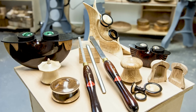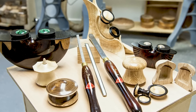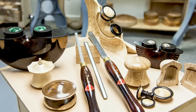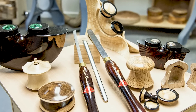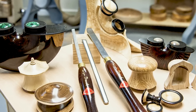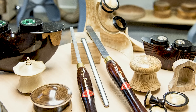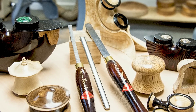With the finished work we have a selection of different boxes. Much of what we've done for the video is end grain work — we're looking at cutting the end grain fibres nice and cleanly. These tools will work just as well on cross grain, so the bigger boxes and more extravagant pieces use exactly the same tools. The round nose scraper really gets in and helps do the profile, gives a nice clean finish. So don't think about this just being for small boxes — they will do an assortment of different work.